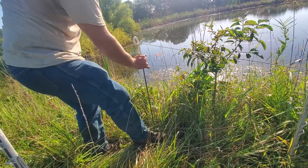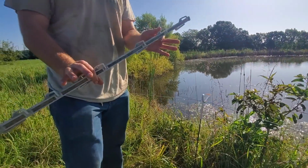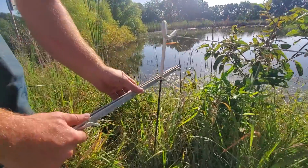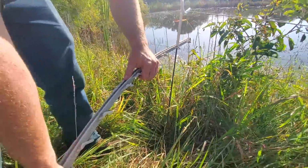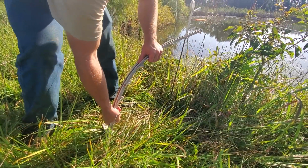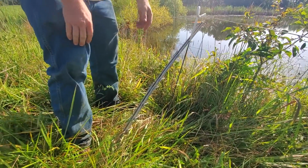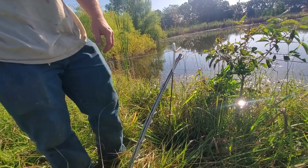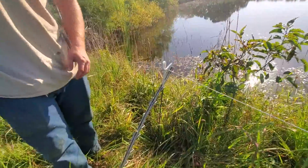So then you just step it in right here. So you've got the pigtail on. Then we'll take a step-in post. We go on the second clip to the top. Slide it right on. What'd you do there? So I just slide it in and then twist. Then I'm gonna bend this post. Now, why you bending that? So when I put it in the ground, there'll be tension on it, but it'll go straight. You took the bend out of it. But that way, if there's a pull on this, it pulls against that post. You're telling me that that's going to be your corner post for holding back 350 head of cattle? Yes, sir. It works. Okay, I'll trust you.